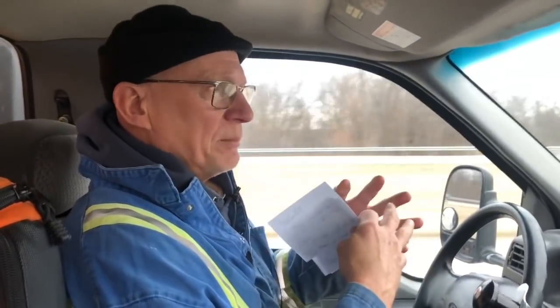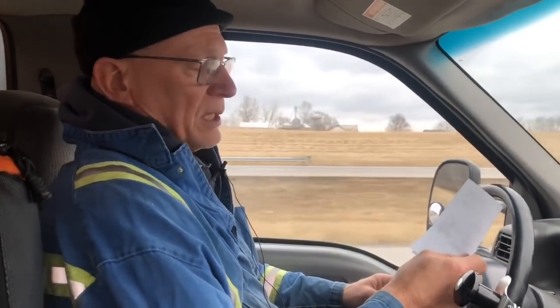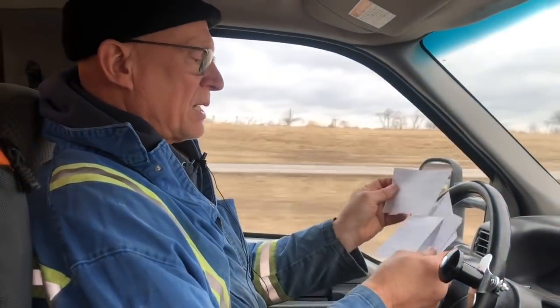Dave found an 80-tonner without 747s. 747's the one with the hypoid gearing. That was a weak link. I've owned a couple of those. Probably wouldn't ever do that again. If he found an 80-tonner without 747s, it's possible that it's an old military 80-tonner with 833 traction motors, and I'm interested in that and knowing where it is and more about it. Let me go through a couple more of these and we'll stay on the topic.